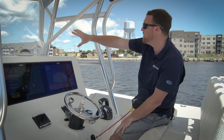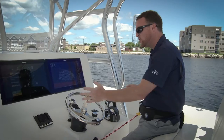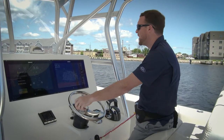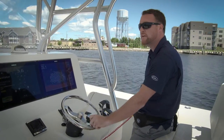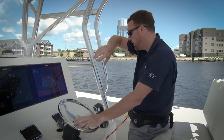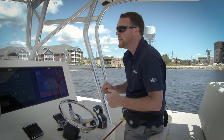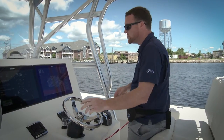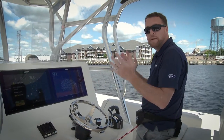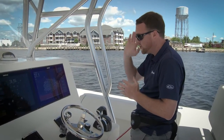Sometimes out on the water we might be heading out and come up to a boat or an obstruction and need to steer around it. You can grab the wheel and drive around it. If you touch the wheel, you'll actually feel some tension because the boat is in control right now. But if you give a little effort to break past the wheel tension, you now have control of the boat and can steer around the obstacle. You'll notice on my precision pilot pad that the resume button is lit up — resume means I've come out of auto heading, but if I want, I can lock back in. I can drive around my obstacle, press the resume button, and it will resume me back onto that same heading I originally started with. I'm still in auto heading, still moving along, and it will continue as long as I want.